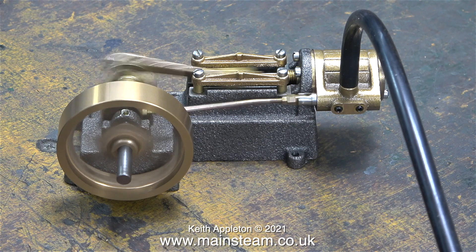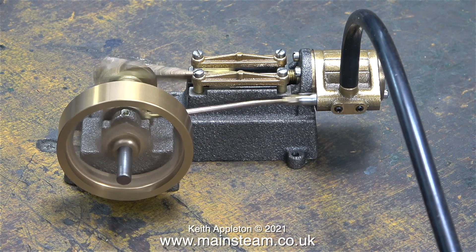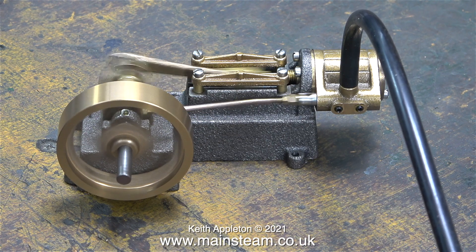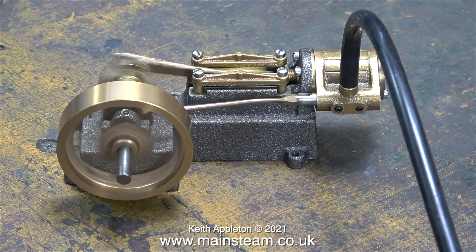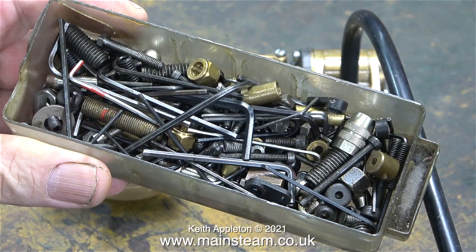There's only one thing that's bothering me and it's the concentricity of the hub of the flywheel — not the outer part of the flywheel or the inside of the outer part, that's okay. I have noticed that quite a few engineers will turn a flywheel and bore the centre but leave the centre boss alone. I don't like the way it looks so I am going to machine it, but not in this episode.